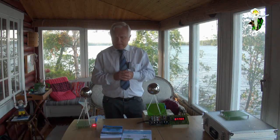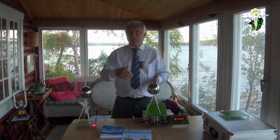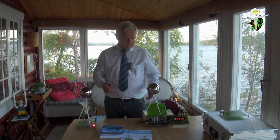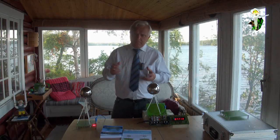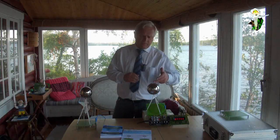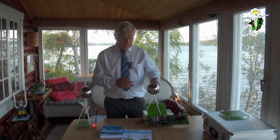Well, these are a lot of possibilities, but this system is even used for other applications as well, for medical application, for instance, to transmit biological signals from one point to another. But this is improvable if you are using two receivers. You can put on here not only one receiver, you can put two receivers, three receivers, as many as you want. But then the transmission from receiver to receiver is a bit better to transmit information. We have found out because you have 90-degree phase shift between the transmitter and the receiver, and as well between the transmitter and the second receiver. That means the phase shift in between the receivers is zero. And this is better to transmit information from receiver to receiver than to use the transmitter.